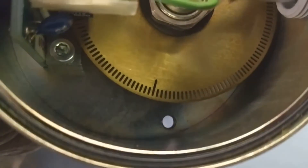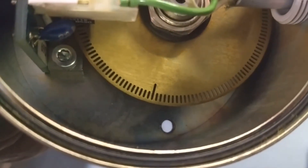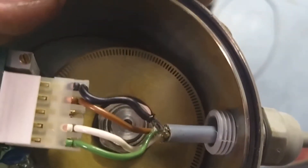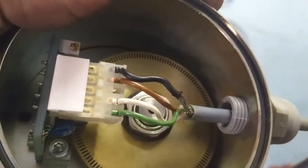You can see optical sensors, and if you look on the wheel there's one slot that's longer — that would be the index pulse for threading. The rest of these slots are for RPM feedback to the control.